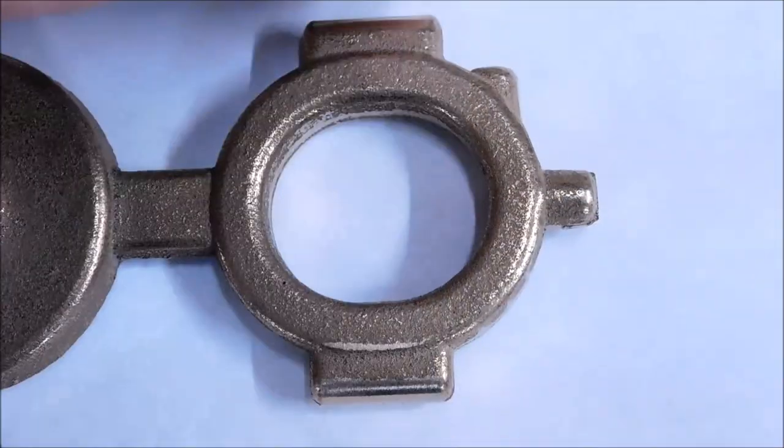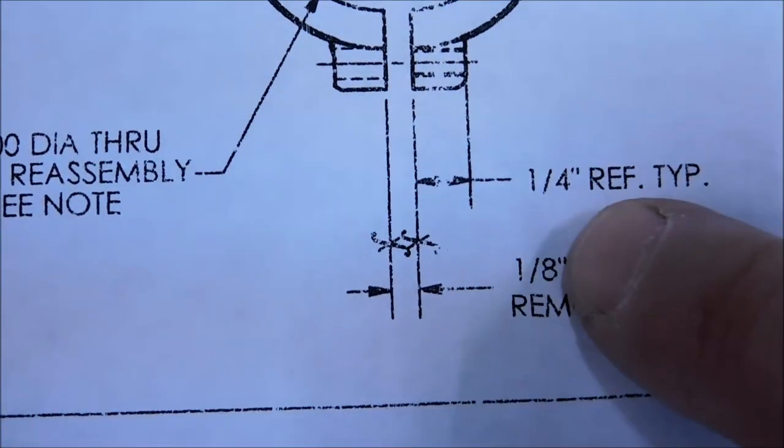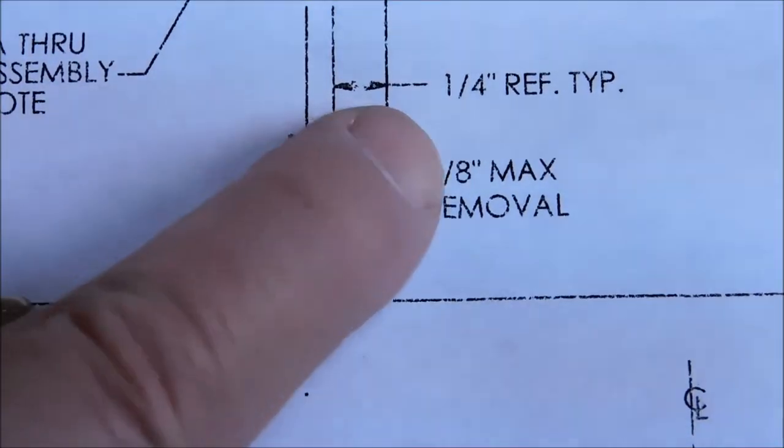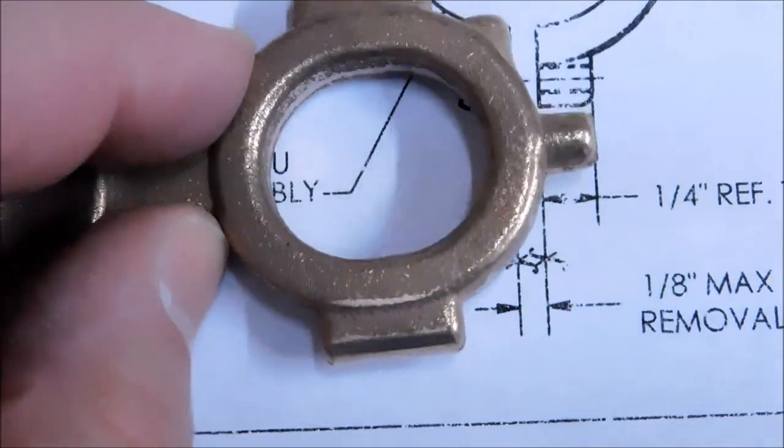If you have something like this, it's going to turn into two pieces. Well, let's use a digital caliper. Go across the center first. Get it to, let's see, all right, 62. Zero it out. I'll measure it long ways. Boom. There you go. That's the anticipated engineered design intent split gap. 120, I think, on the print. Let's see what it says on the print. Pretty sure it says 1/8. Yes, it does. 1/8 in imperial, 125. That's about 3 millimeters. So that falls right in line with what they recommend on the print. And that's the easy way to do that.